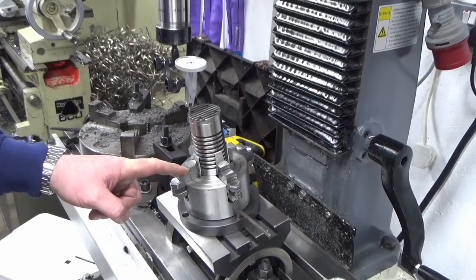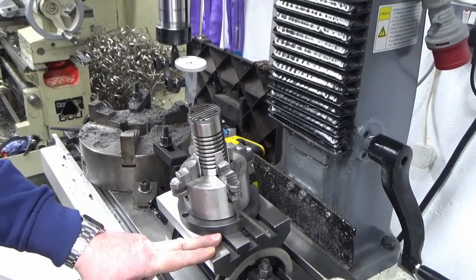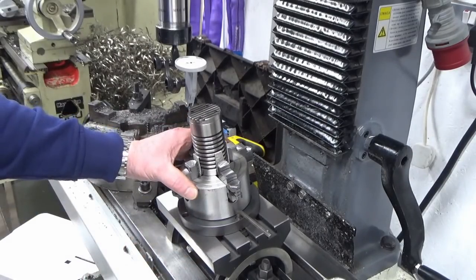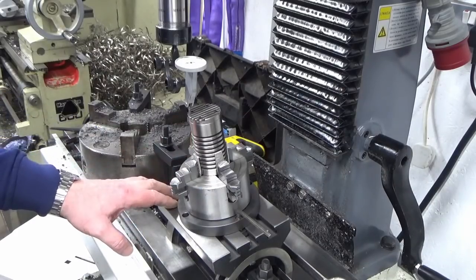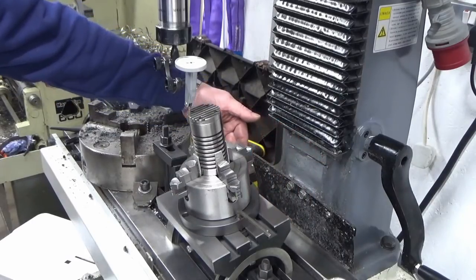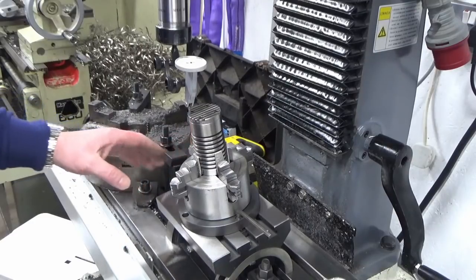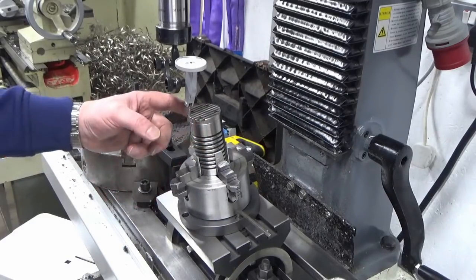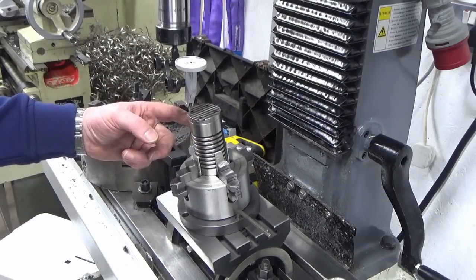It's pretty sturdy, so I've got my angle table on the bed set to the right angle for the valve seat face. I've got my four-jaw chuck off my small rotary table that fits this quite well, so we've dropped that on. I've clocked the back face of the angle table into the x-axis so that I know my angle is true and it's not skewed. And we've got my part in, we've clocked it up and down the outside, we know it's sitting square.